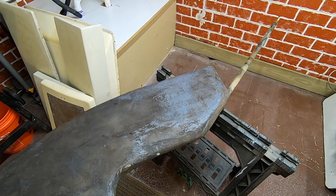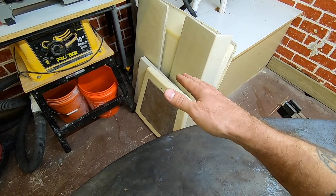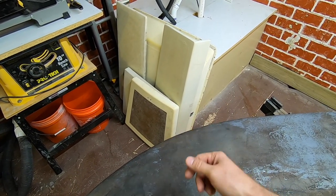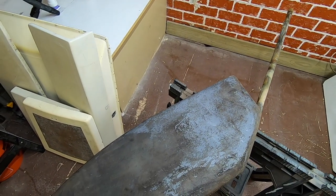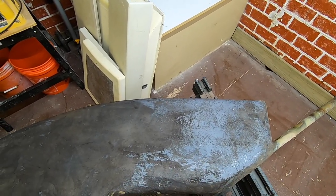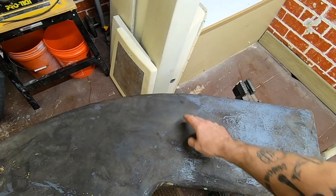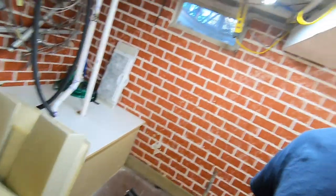What happened with James: he was heeled with a lot of weather helm and the rudder was out to one side, so when he hit something that was enough to dislodge it. I think the steering was just spinning in place somehow after that. That's a similar concern to what I have, which is why I want to open this up and make sure these rods are still in good shape.